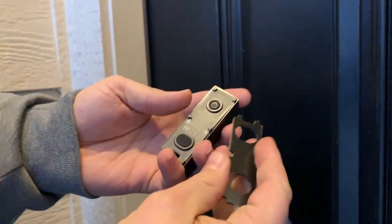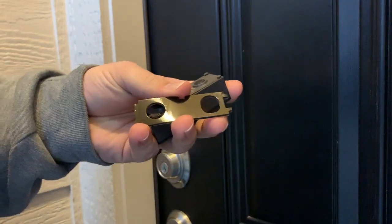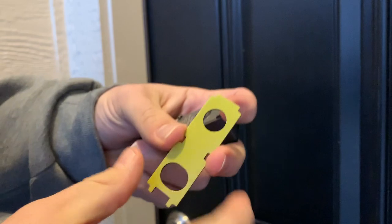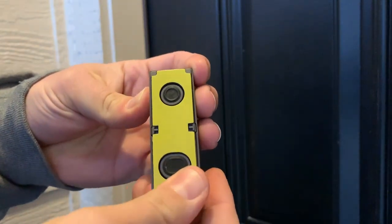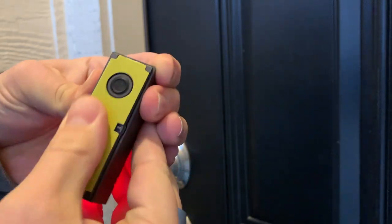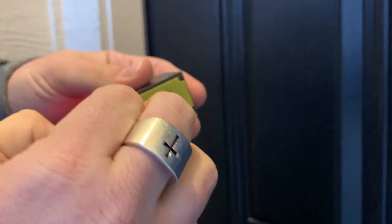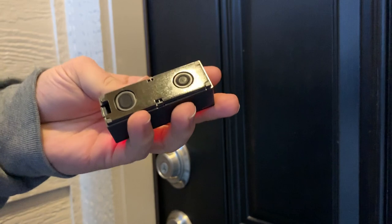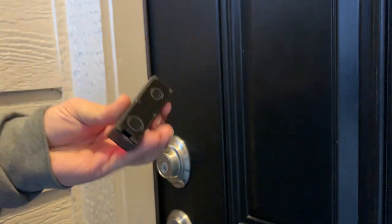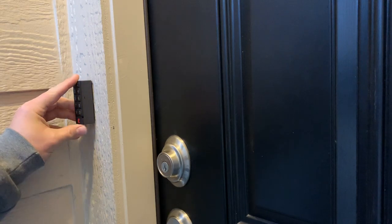You want to take your double-sided adhesive. Notice the holes are different shapes — one's more circular, one's more oval. You want to make sure that it's lined up over the correct holes on the actual back of the keypad. Once you adhere it to the keypad itself, you want to take off the other side of the double-sided tape and position that onto your door frame or wherever it is that you want it near the lock. I'm going to go to the left of the door here, slightly above where the deadbolt is. Press it on, make sure it's sticking real good.